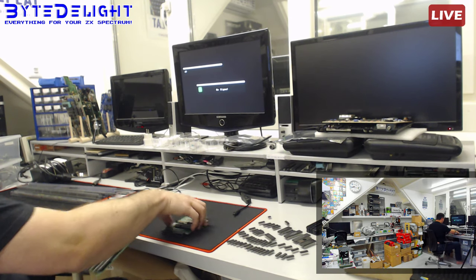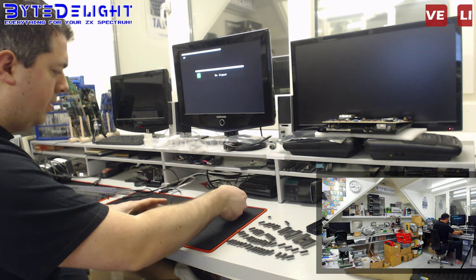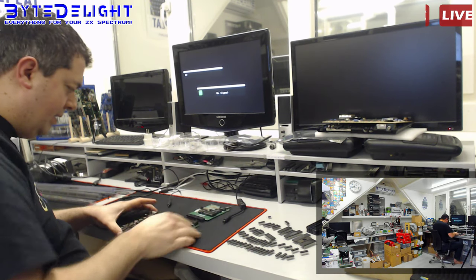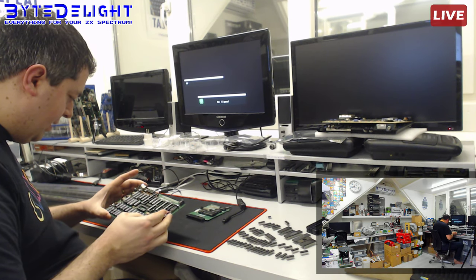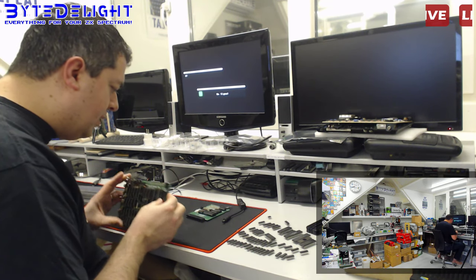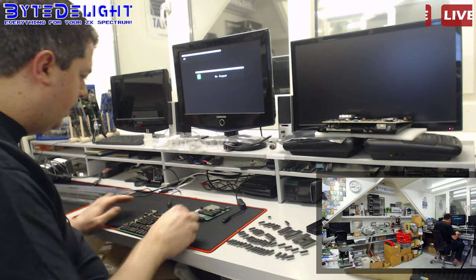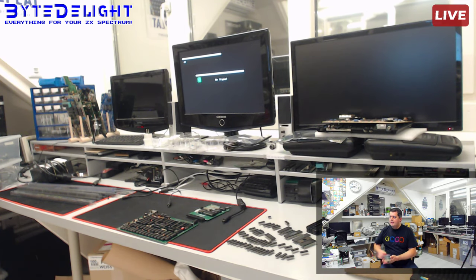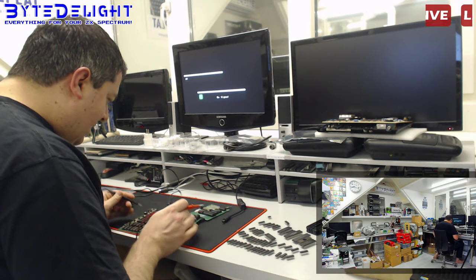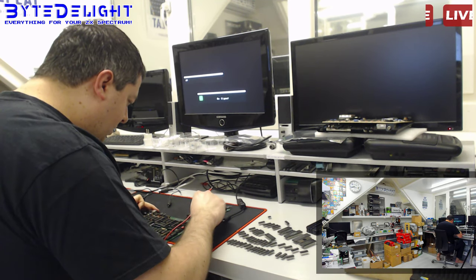Right, so first let's test again if we still have 5 volts and 9 volts. It shouldn't have changed in any way, but I just want to make sure. Oh! And again, we do not have 5 volts for some reason. Why? Okay, we did put back in all the parts here. Let's check for a short. This board is such a mess. I should have just gotten a blackboard. Anyway, 5 volts. Yeah, we now have an actual short on 5 volts.